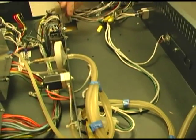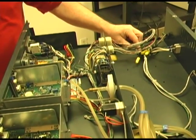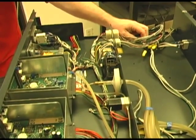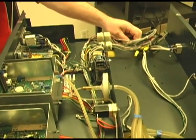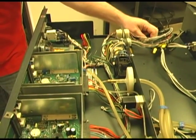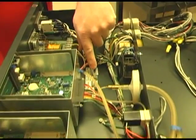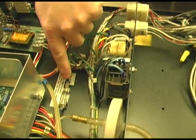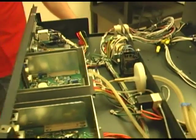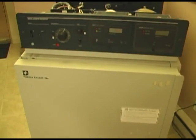This unit also has an AC fan that has to run all the time — it circulates the CO2 inside the chamber. That's very common to most incubators; they all have some way of circulating that air, and many have fans inside like this one. And let's not forget the fuse — it protects from high voltage spikes. If you see no displays at all, that's most likely where your problem is. Thank you very much for attending this session on introduction to the incubator from Biomed Buddy.